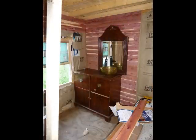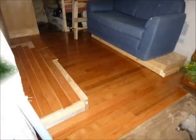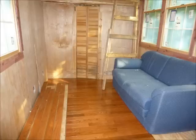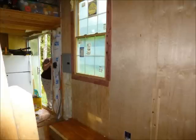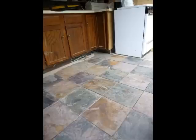We started working on the house again. Here's the bathroom — we started putting cedar in, which I love. It smells fabulous. We stained the outside of the tiny house red and put hardwood floors in. This is Bruce hardwood flooring and it's absolutely beautiful. We finished the paneling on the inside and used some of the cedar to make trim for the windows. All the little finishing details — mostly pretty easy to do but time consuming. We put a slate floor in, had to put hardy backer down first, which added some weight to the house.